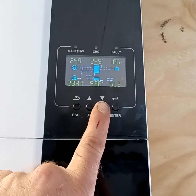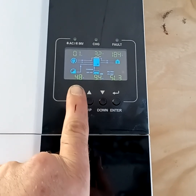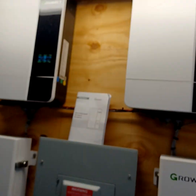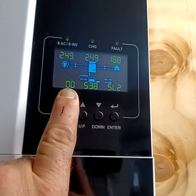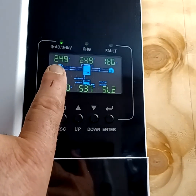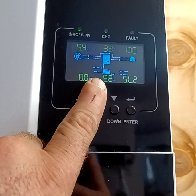If we come down the screen, we'll see a grand total of 61.8 kW have gone in through this particular inverter. Right now it's 4.7 amps, about 1,400 watts and climbing. We have inverter one, two, and three on three strings. Number four does not have a string yet — the customer is in the process of buying more panels. As you can tell, there's zero voltage coming in from the actual PV line. We are doing an AC bypass as of right now, basically just taking the Generac transfer switch's house power, transferring it over to the inverter so it can bypass the system and keep a charge on the batteries, because I'm in float trying to balance the batteries. 9.2 amps going into the battery bank.